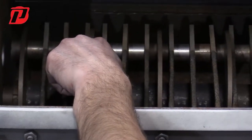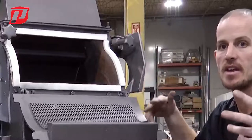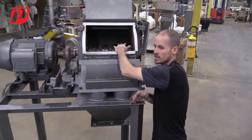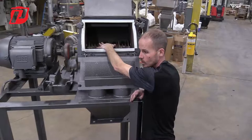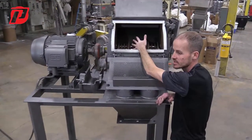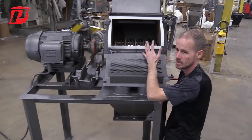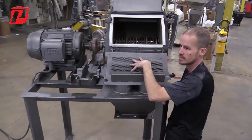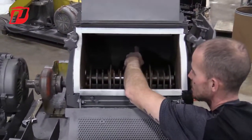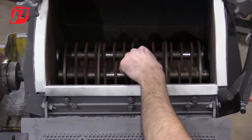Once we have everything out and have our spacers, how the hammers get installed is based on the pattern or print that was sent to you when you bought the equipment. They all have different standard sizes — as I talked about in a previous video, we can go fine or coarse, there are coated hammers, non-coated hammers, quarter inch thickness, eighth inch thickness, and all different types and styles. It's very imperative that you pay attention to the print to reinstall your hammers and spacers, because the spacers will have different spacing depending on the pin, ensuring that hammers from one pin don't come into contact with another.